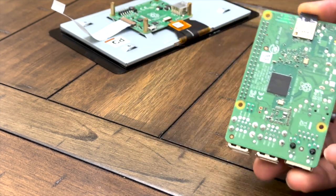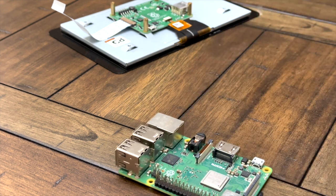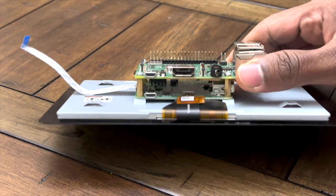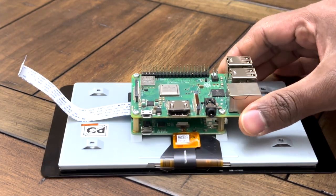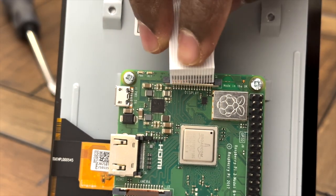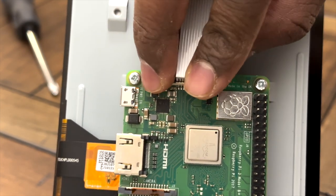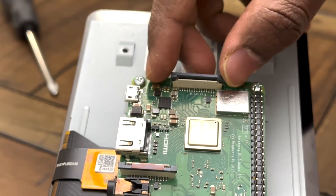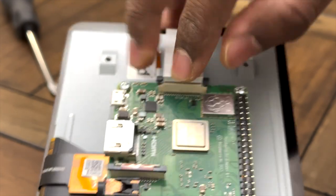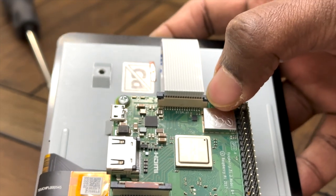To connect to your display, follow these steps. Make sure the Raspberry Pi is powered off before wiring to avoid any damage to the electronic board. Attach the Raspberry Pi board to the back of the display using the screws and standoffs provided. Carefully connect the ribbon cable to both the Pi board and display control board, noting the orientation of the ribbon cable pin — don't break it. Be sure to carefully release the tabs on either side of the socket, slide the cable in all the way, then secure it by pressing down on the tabs until they lock in. You shouldn't have to force the cable.